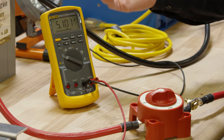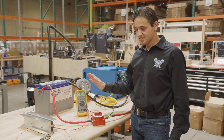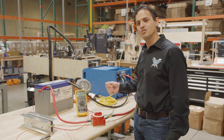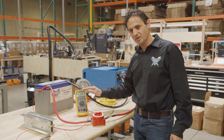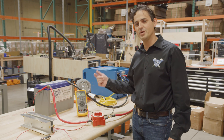That 5 volts is meaningless because now the battery is disconnected. The reason it's disconnected is because the battery itself detected a short circuit. When you try to connect to empty capacitors, it's basically like a dead short. You know this is a short circuit event because it stays at 5 volts — it's not reconnecting.